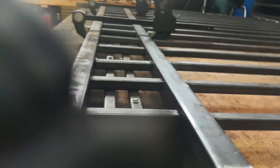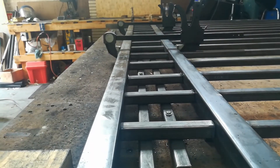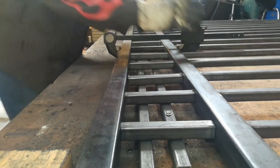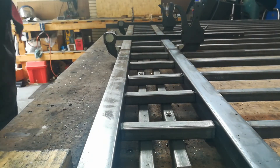If you're within a quarter inch — over a span of 94 inches — that's pretty good. It's not worth the time to try to get it perfect because it's going to move a little bit anyway once you start welding.